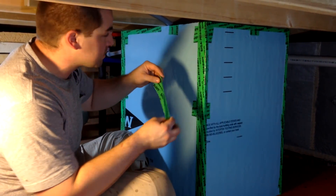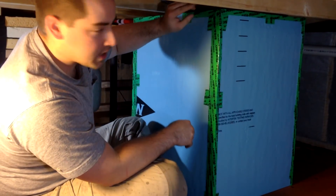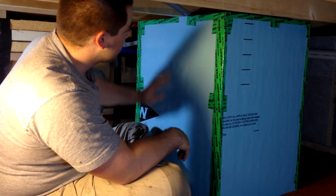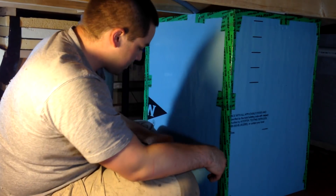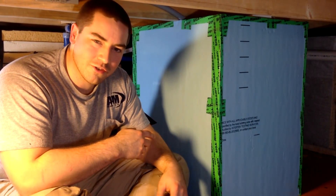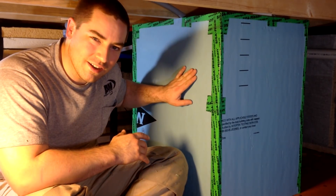This is our last piece of tape to seal the box off. In case anybody's wondering why I used one-inch foam instead of two-inch or something else — the reason was that I only had one inch between the underside of this joist and the top of those brass elbows, and it was a tight fit to bang it in there. But now it's in place, it's sealed, it has that liner, it has the alarm up here, and it should be pretty good. The water tank is fully insulated, so I'm going to put the electric meter on the circuit breaker for this guy and measure it over the course of the next couple of weeks to see what kind of electricity we use. Hopefully we knock that down because it shouldn't need to heat the water much — only a few degrees from the big solar tank — and now we've cut down on the standby losses.